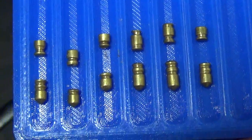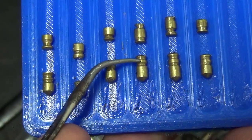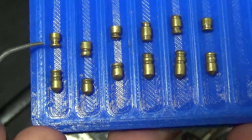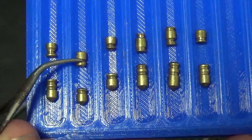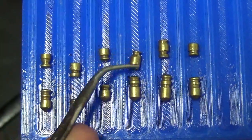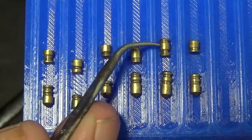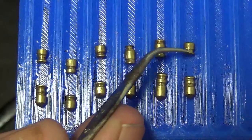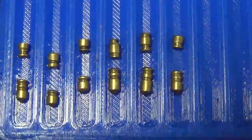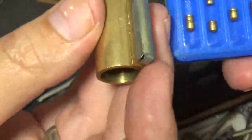Take a look at some pins. We've got double serrated key pin in number 1, single in 2, single serration in 3, double serrated in 4, same in number 5 and number 6. Drivers, I'd call that a spool in number 1, serration in 2, serration in 3. Now I don't know if those are called ASA-like pins, but I think they are, where they got like a ring around each end. And this one's same way, but it's got a deeper one, and then a single serration in number 6. And like I said, the springs are stuck in that little teeny short top that it's got there.